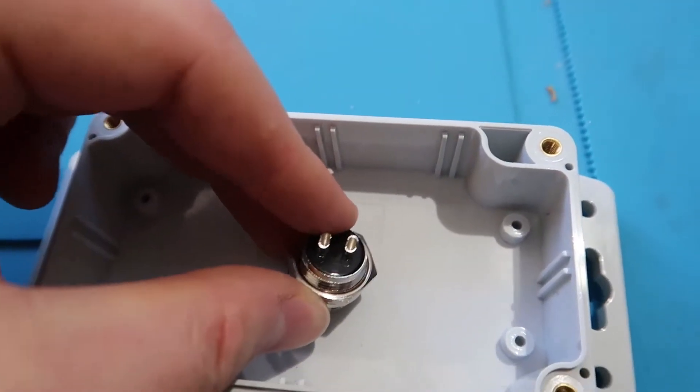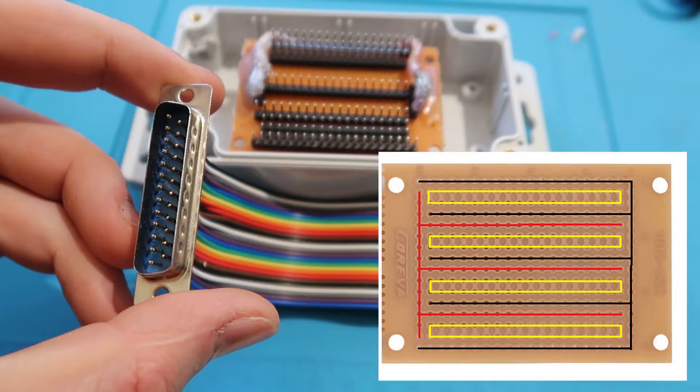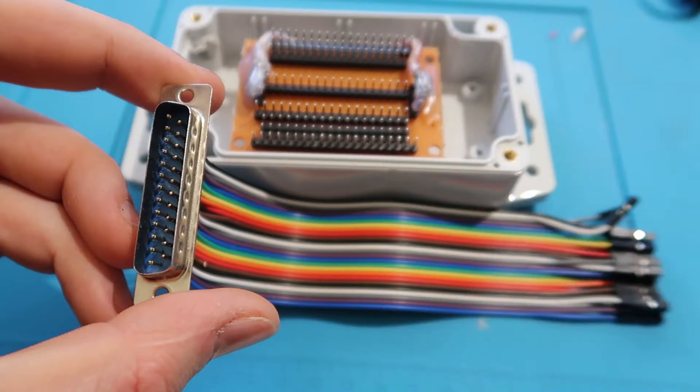I did cut a hole out which I changed the position later on. As for that prototype board, you can see there in the background I've got the positive and negative leads running into a couple of those rails. I then soldered those rails into the jumpers along the actual board — that way I can plug one end from the sensor into it and the other end goes to the monitoring equipment in the bottom of the scrubber unit. It kind of looks complex but this way it's easy to chop and change things, and if a certain sensor doesn't run off five volts — it might run off 3.3 — I can use that pin for a different voltage.